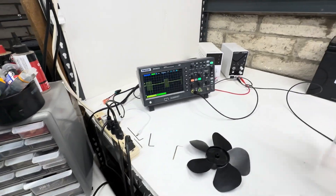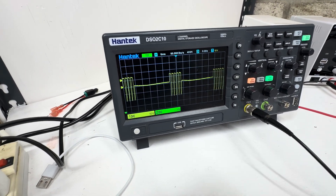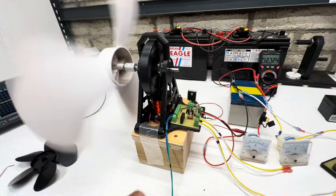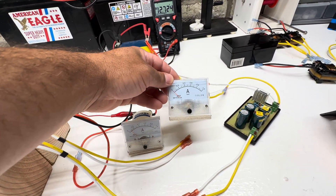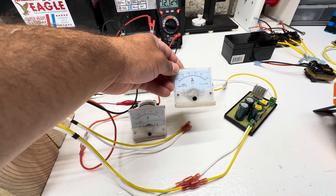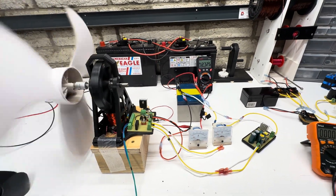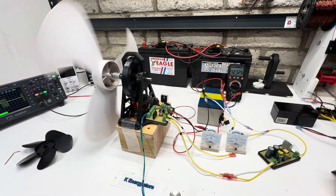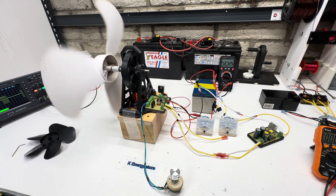Here's your scope shot. It's broken down into 4 pulses per magnet, and with 8 magnets that's 32 pulses per revolution. The cap dump is converting that into amperage — 14.5 volts at about 500 to 600 milliamps — which lets you run this battery a long time. If you guys have any other questions, just leave them in the comments. Thanks for watching and I'll see you next time.